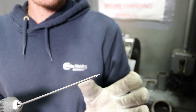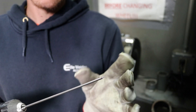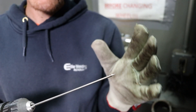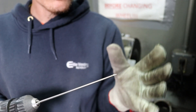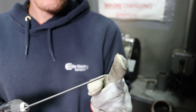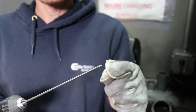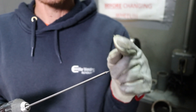I just wanted to pause and evaluate the tungsten after sharpening. You can see we got it to a very, very sharp tip. I have a rule of thumb: you want it to be almost needle sharp — if it will draw blood, it's probably sharp enough; if it won't, it probably needs to be resharpened. One important thing to point out is the degree of angle — the angle of the tip is very similar to a pencil coming straight out of a pencil sharpener, and that angle can dramatically affect the shape and size of your arc.